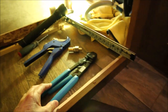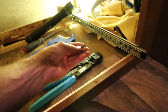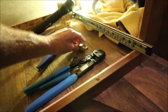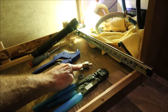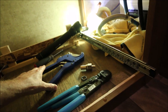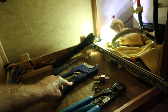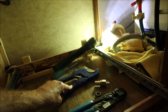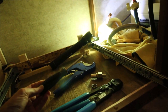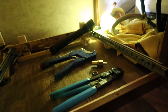These tools are not really that cheap — that's about a $65 clamping tool. The clamps themselves are relatively cheap; you can get a whole bag of them for about six bucks. Your fittings, you probably have about six bucks invested. They make a really cheap PEX cutting tool — I recommend you get it. This one is for PVC, but it does the job. The worm gear clamp — you'll need a driver for that. Let me install it so you can see what it looks like in the end and if it works.